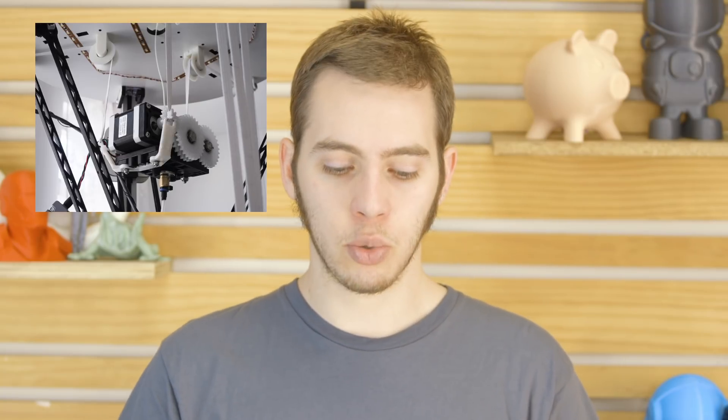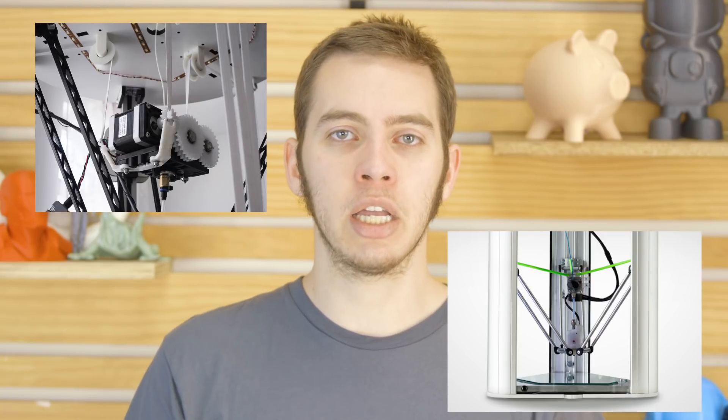There's a third, not often seen setup called floating or flying extruders. Instead of mounting the motor to the frame or to the printhead, it just floats between the two. With strings and counterweights it suspends the extruder above the printhead, giving it a very short filament path, which means it's easier to print flexibles and troubleshoot, but by having it suspended it reduces the mass of the printhead, giving you the advantages of Bowden. I've really only seen it on Delta printers, and it looks like it works on those machines — it's just something you don't see very often.